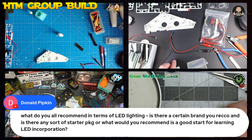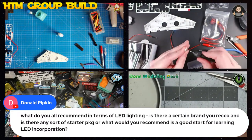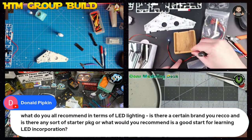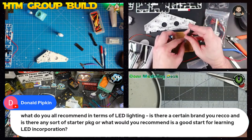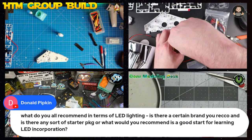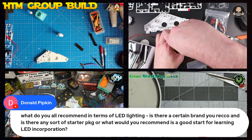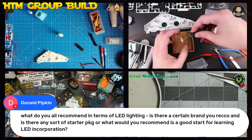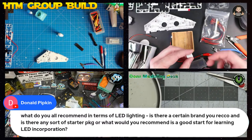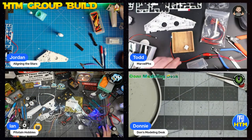But at the most basic thing for LEDs, Donald, you just go on Amazon, type in 3mm or 5mm LED, and they'll have variety packs with a bunch of colors, hundreds of them for like $10. You just need some thin wire and Todd's website, and then you'll realize you need resistors. And they have variety packs of resistors. You could start powering things with just AA or 9-volt, or button cell batteries, and then move up to a power supply later on when you find the expense is worth the usage. But yeah, Todd's website.